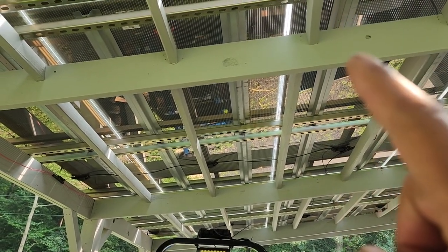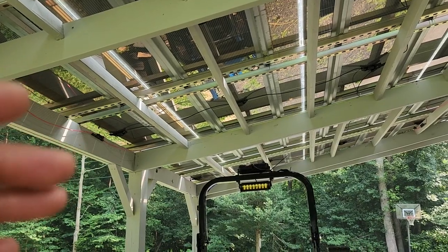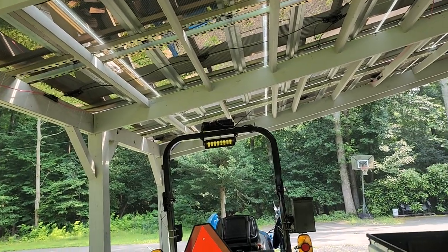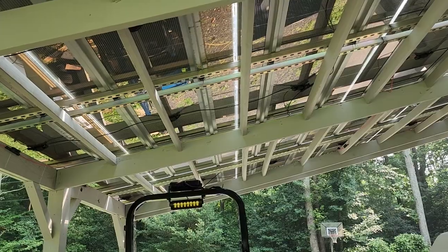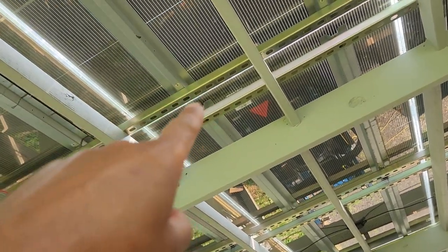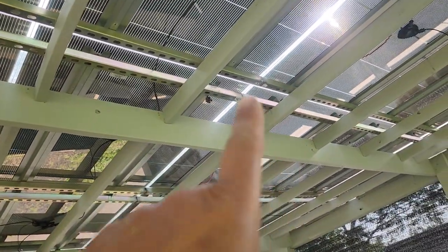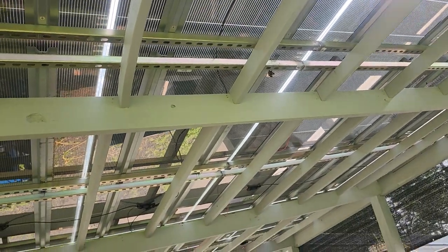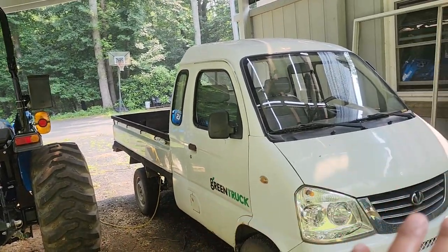In between, to fill the space where typically you'd have a roof come down, I locked in your standard two-by-fours — all treated material, all at 24-inch center — that locks the whole structure in place. Then I ran the super strut, which you can check out at Home Depot or pretty much any hardware store. This is the heavier version, about an inch and a half thick, with all different types of adapters, railing screws, and fittings. It's similar to 80/20 but cheaper — instead of aluminum it's galvanized steel. Using the same concept, I can slide the panels in and out; it's just a railing system. I ended up welding them together for the length I needed — about 17 feet total.